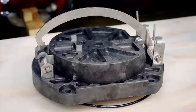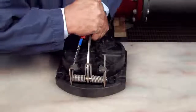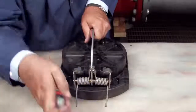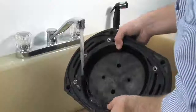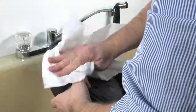To open the number two check, you'll first need to release the tension holding the clapper shut. Locate the two cam arm torsion springs. With a 3/8 inch nut driver placed over the torsion spring, move the spring away and around the retaining bracket to release the tension. Do the same with the second spring and the cam arm will open with no tension. Clean the check with water to remove any dirt or debris, then thoroughly dry the unit before proceeding with the inspection.